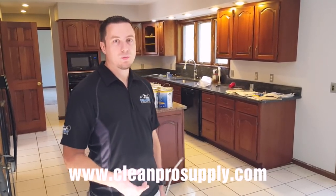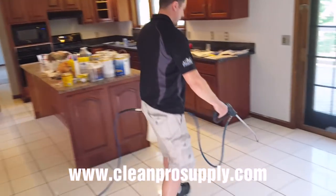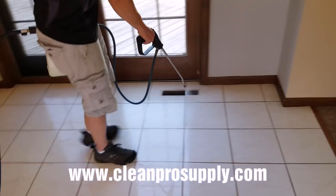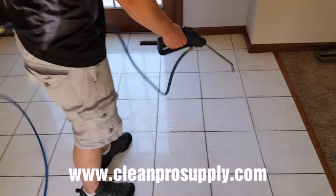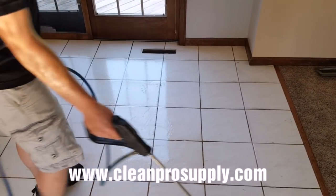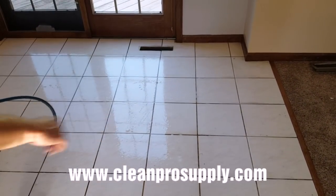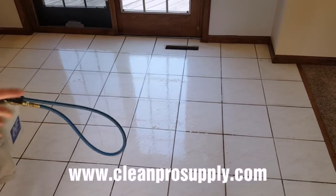It is pretty rare, but something you have to be cautious about. When I'm spraying, I keep about four inches from the wall. You can see from me pre-spraying earlier it's already kicking out some of the dirt. I keep about four inches away so I don't get overspray onto the baseboard or onto the carpet. By keeping that spray four, maybe six inches away, then I can take a brush.